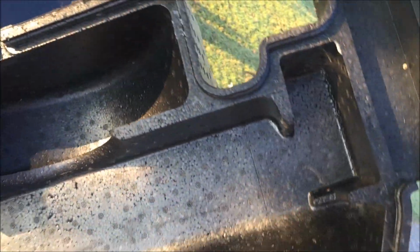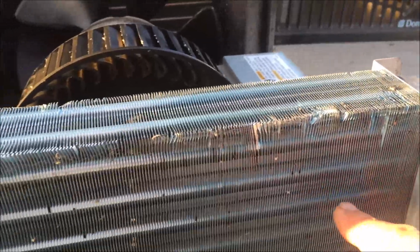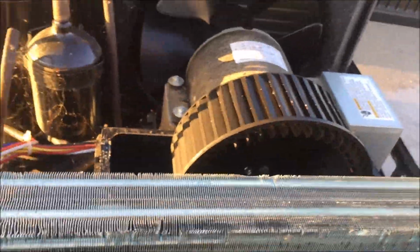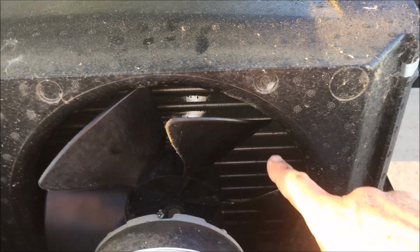under your insulated cap. So the webbing and the spiders and stuff will get hung up in here a little bit. There's a gnat or 2 in there. It's really not that big a deal. If you get an old toothbrush, you can pull that stuff up out of there. Rinse it on both sides. Rinse your blade. Rinse the condenser coil on both sides.